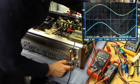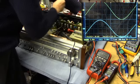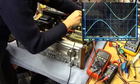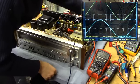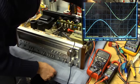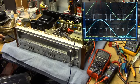I wonder what that occasional glitching might be. Oh, there we go. Given how irregular that was and how it's not responding to knocking, I'd say that's a dodgy connector. These adapters I have aren't the best. Yeah, there we go. Dodgy connector, no doubt about it. Righto. So let's see if we can hook some speakers up to this thing. I want to hear it sing.